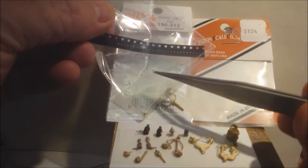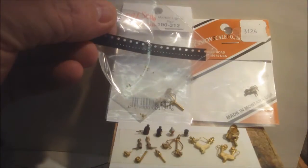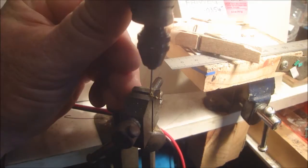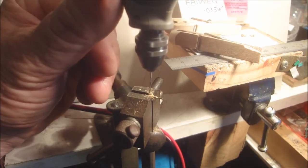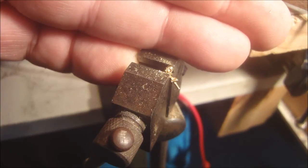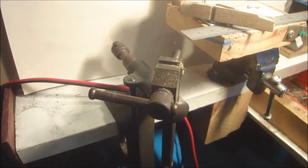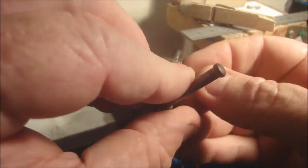You can see these little tiny things — you can get two or three on a pin head. You can solder to those, or if you can't, you can always buy them pre-soldered from various places on the web. We're going to start drilling now with a 0.9mm drill. Okay, we've drilled the hole up the base. Now we need to drill the port holes out for the actual lights — just drilling through until we meet that hole we've drilled up the inside. One more hole to drill, which will be the front hole. Having the right tools and doing it this way makes life easy.